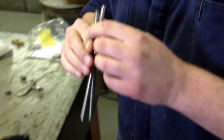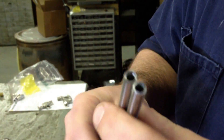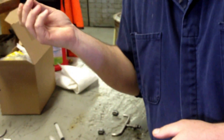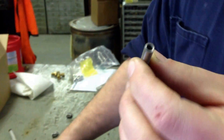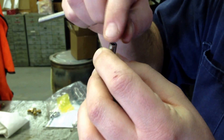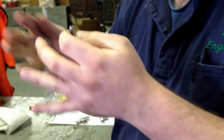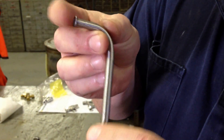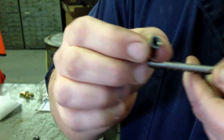We've got two of them cleaned up. They're nice and pretty on those edges. Now something you don't want to do with stainless is you don't want to use this type of cutter when you're trying to do a flare fitting. As you can tell it rounds it out, and then when you go to flare it, it's work hardened so it won't flare out. It'll just push out and you'll end up with something off-centered - it squeezed it and messed it up.